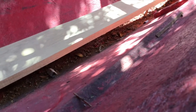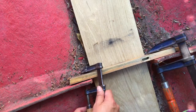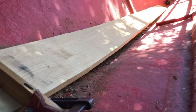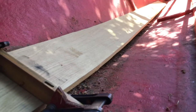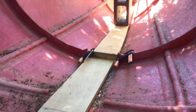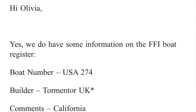Here is my first piece of the keelson — so excited, it's looking great so far. One thing I did realize is that the old brittle keelson wasn't exactly what it was supposed to be, so I have to leave this piece in the boat to get it to shape a little better. I ended up clamping it down at the bulkhead, which helped quite a bit. I'll let it sit there for a couple of days, and when I'm confident it's right I'll start adding the quarter-inch sawn pieces to the bottom, layer them up, glue them together, put all the scarf joints together, install it in the boat, and get it fiberglassed in.